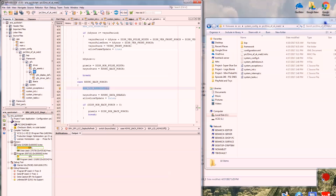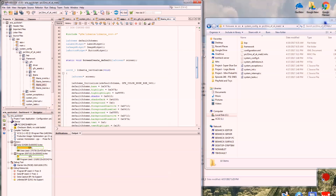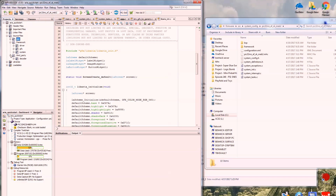You have a couple of libraries here. HAL — the Hardware Abstraction Layer — is a very low-level library that basically draws circles, lines, and blits data onto the screen. And then there's lib ARIA. At first I thought this was just a library name, but no — it's Library ARIA. These names are really confusing. This one is important because if you look into initialization, this is what gets called in the main setup routine — this is what's actually creating a test display. That's how the folders work in MPLABX Harmony. Anything changeable by you or by your Harmony configuration is in app; framework and third party you shouldn't have to change.